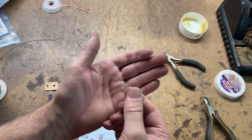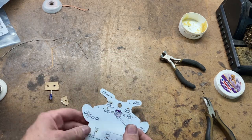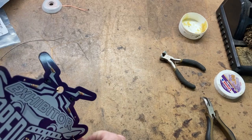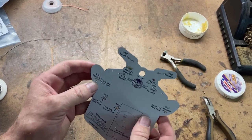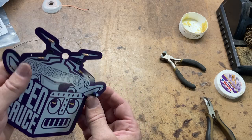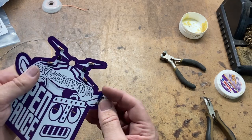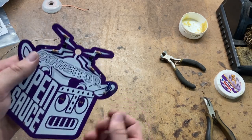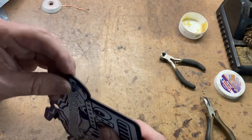The capacitors and LEDs, however — you have to look at the actual unit itself. This is pretty standard: there's a long leg and a short leg, and in the electronics world the long leg is the positive. It says that right on the board — long leg through here on the positive side. So we just have to make sure we install that correctly and solder it in place. These caps do stick up a bit, so I'm going to bend them over to be more flush with the board, and then put a little bit of hot glue or something to hold them in place so they don't move.